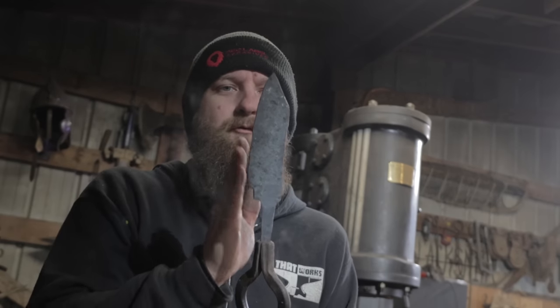So I like his method a lot. And because we hot cut the tip off, we got the grain going the way it should. So in theory, this is better. Let's grind this one.